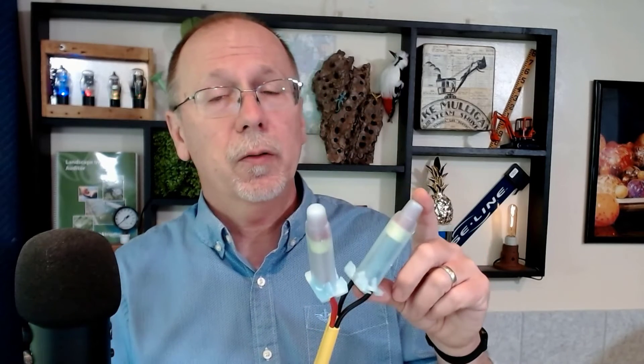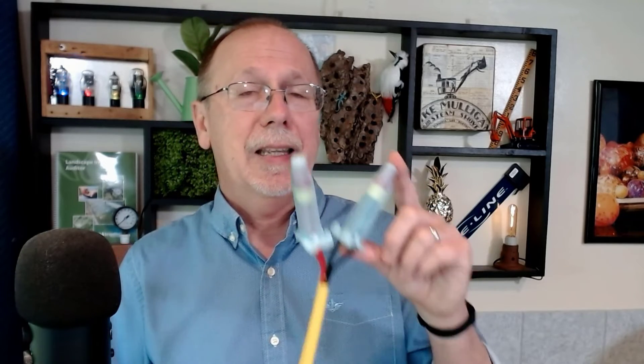Two-wire runs closer to 30 volts, which would exceed the 24-volt rating of standard DBRy splices. To meet UL rating requirements, you must use DBRy-6 splices. What you never want to happen is for that gel to heat up and drain out, leaving your splices exposed.